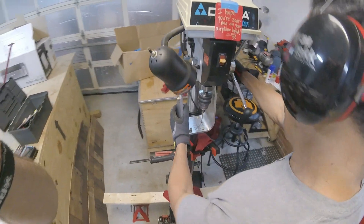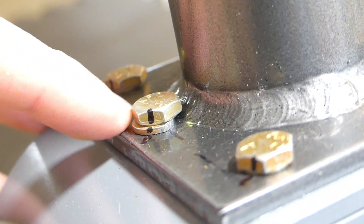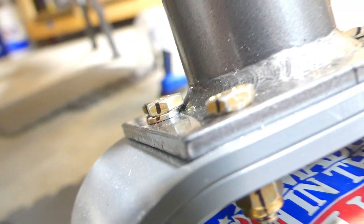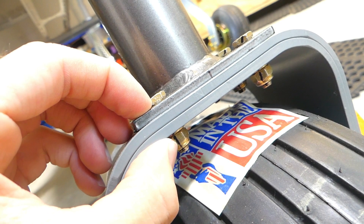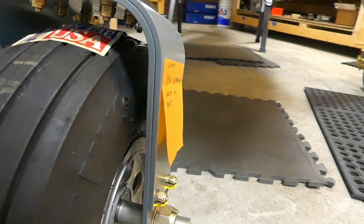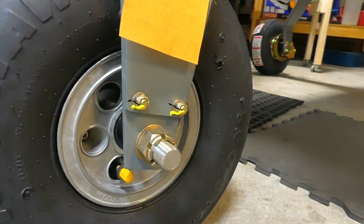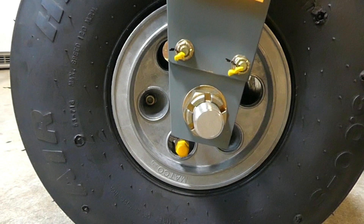One important thing: keep the bolt holes far enough from the weld so the bolt head doesn't rest on it. On one bolt I had to fabricate a custom washer — basically grinding down almost half a washer — to elevate the bolt head just above the weld. Keep that in mind. I also still need to safety-wire a couple of the nose strut bearing bolts, and for the nose axle I plan to drill holes for a cotter pin to keep the nuts from rotating, since it's subject to rotation.